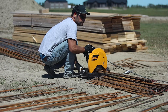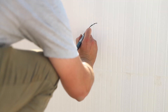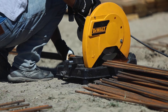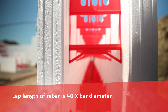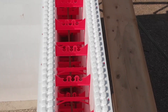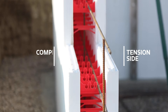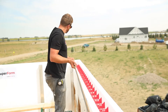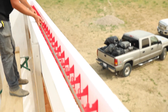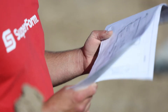To improve efficiency, after the first row of ICF has been stacked, your horizontal rebar measurement can be written on the wall and cut ahead of time. The lap length of rebar is typically 40 times the bar diameter. It is very important to remember that below grade rebar is placed on the tension side of the wall. Once you're above grade, place rebar in the center of the wall as there is no tension side. Sometimes a job will spec for different placement, so double check.